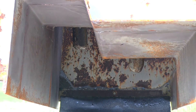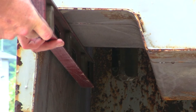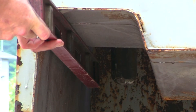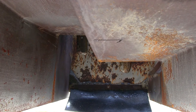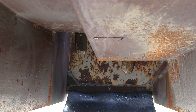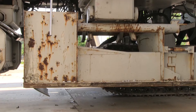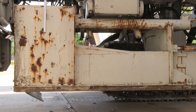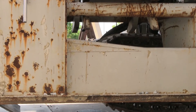To adjust the height of the vibrators, look from the rear of the mold and place the tip of the vibrator approximately two inches into the top of the final profile. A two-by-four or four-foot level can be handy in gauging the depth. Make sure to sight from the finish end and not the choke. Setting the vibrator depth off the choke will cause the vibrators to be installed too high. The choke is the portion of the mold directly behind the hopper — it slopes up into the hopper and is not the final shape of the concrete.